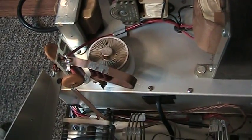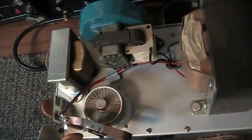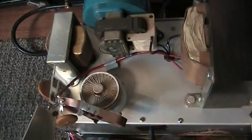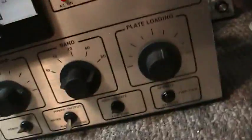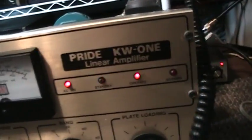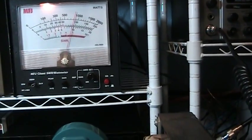I did have to change the chimney for the 8930 due to the bigger sides, but other than that it fits into the socket and voltages are the same. We're just gonna key her down real quick with the 8930 tube in it — should be all tuned up — and let's see if we get audio. Hello, hello.